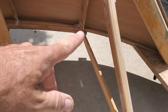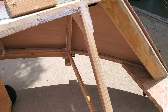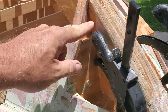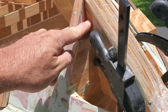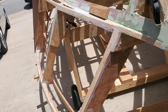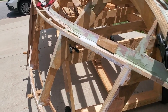This last frame was left to the builder's discretion where to place it. I basically raised it all the way to the top. Now I know it should have come down — this point here should have reached probably about there. That's why I had a lot of fairing to do and adjustments along the inner and outer chine. That was my problem, but I got it all addressed and taken care of.